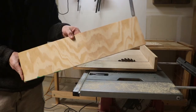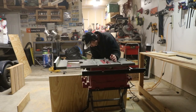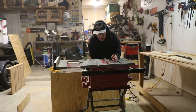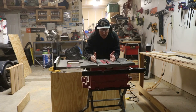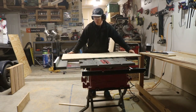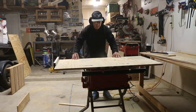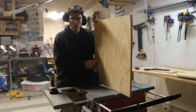Here's the kickboard. This next piece will be for the floor — it's going to be 24 and a half inches long. And that'll allow room for the kick plate in front of it and the backboard behind it hiding the floorboard. Now I'm just going to put pocket holes in the floorboard, the kickboard, and the backboard.